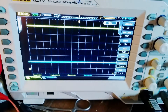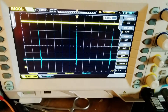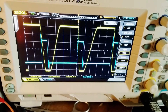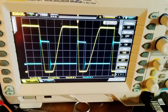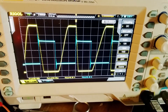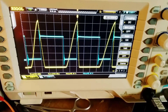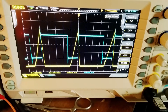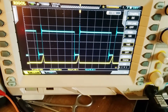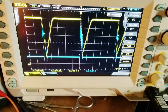If I turn this on and wait for the ESP32 to boot up — the blue trace is a 100 kilohertz pulse-width modulated signal which goes from 0 to 100 percent modulation, and the yellow trace is a 0 to 30-volt signal which is inverted and goes from fully on to fully off.